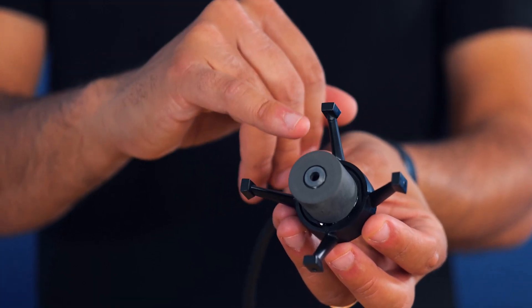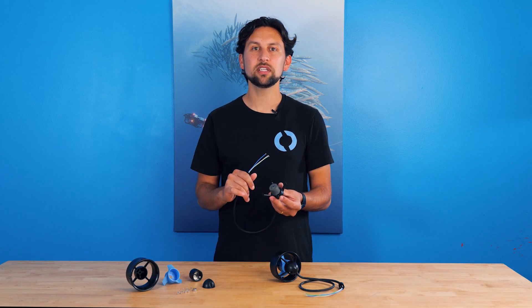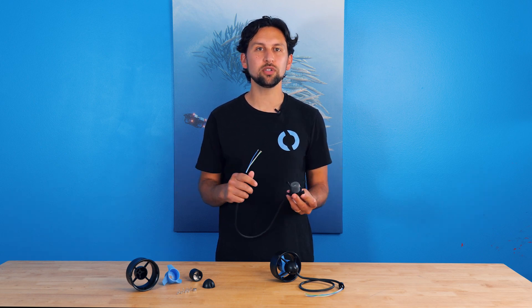That makes for a motor with just one moving part, fewer parts overall, a compact size, and a significantly more affordable price. Let's take a look inside. I've got a disassembled thruster right here. At the core of the thruster is the motor stator. In here is an iron core and copper windings, which are contained in an overmolded material that's waterproof and electrically resistant. There's a stainless steel stem in the center that holds the thruster bearings, and unlike most motors which use steel ball bearings, we use high performance plastic bushings that don't corrode and are water lubricated.